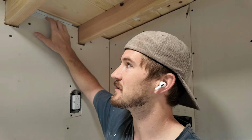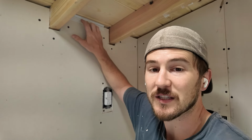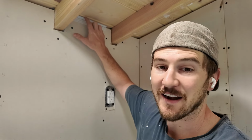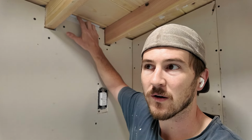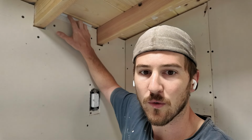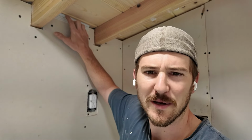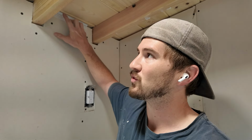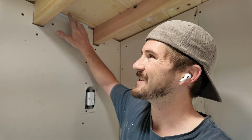Now, in my case, because there's a slope in the roof, and it's probably the case for a lot of people, there's gonna end up being a 1/4 inch gap. That I'm just gonna fill with either regular interior paintable white caulk or big stretch caulk, because I'll have this nice joint on all of these to represent the drywall to wood transition, and then just seal off that gap entirely. These things are super cheap.